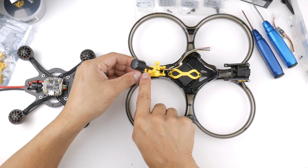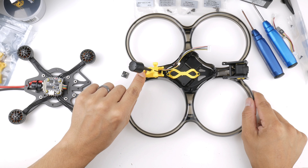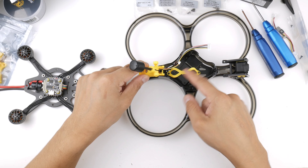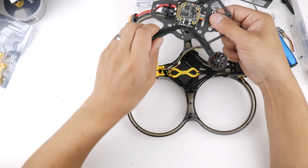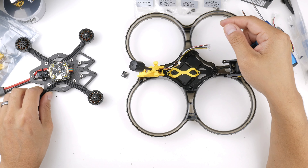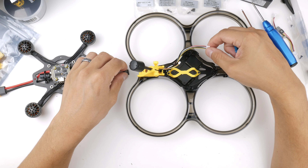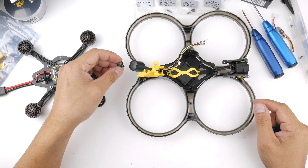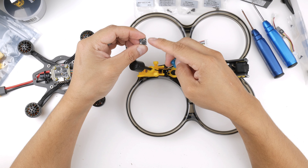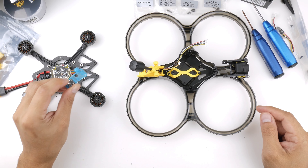For the wiring I'll try to get it through the hole here which is for the analog antenna SMA connector, then pass it through the channel underneath, past the standoff and into the flight controller. I'll show the wiring diagram when I do the soldering and explain which UART I'll be using for the EP2 and the O3. I'll solder the wires first, then wrap it up, then pass it through.